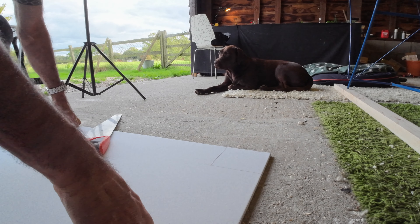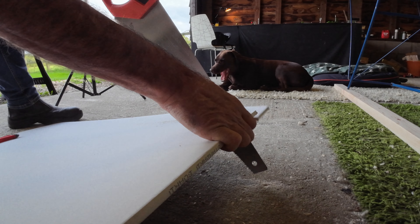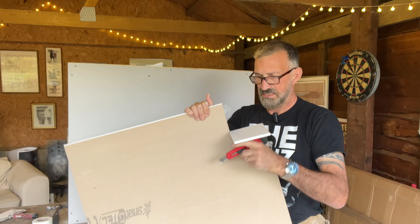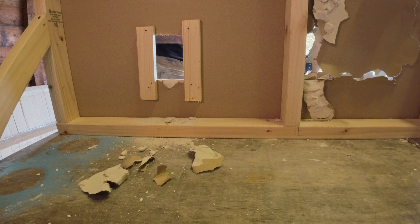The thing with cutting plasterboard is that you can cut down this way and break it, but for the other direction you need to saw it. So we go down there, follow the line nice and steadily, hands out of the way. Then with an old hand saw, cut to the line, and this will break like this. Using your knife, cut that off. So let's pop that in.